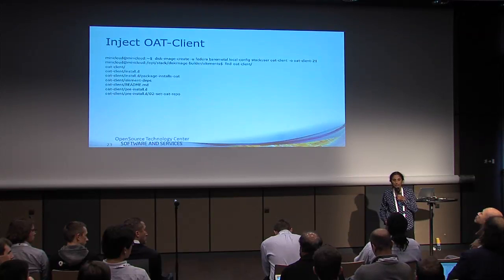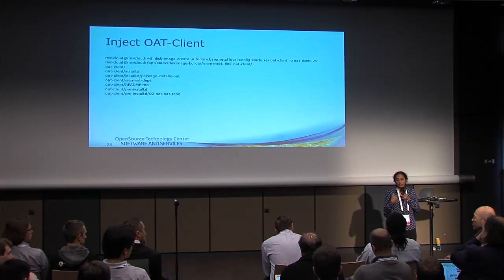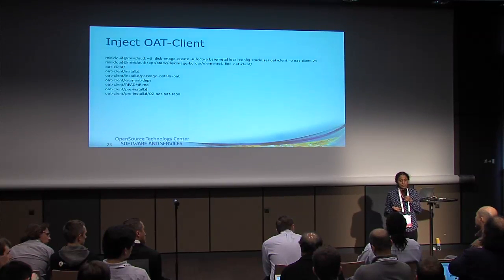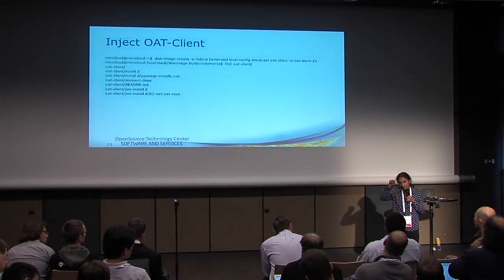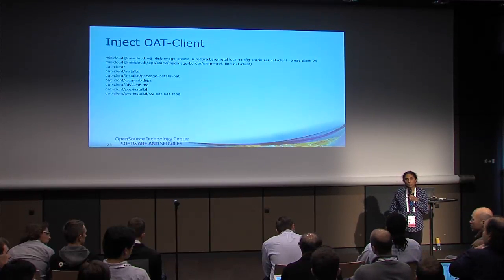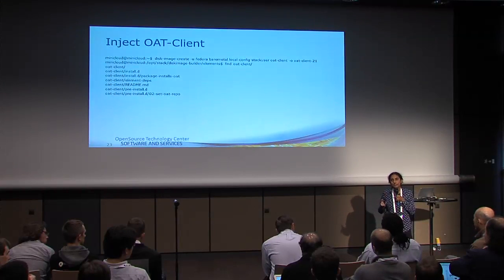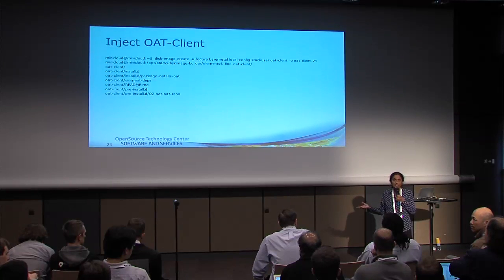Question. Is the random number generator exposed to the VMs? No. This one is mainly for your communication so that you don't have replay kinds of attacks. Like, I'll ask you, hey, give me your PCR values, and this is for generating a nonce. Or if you ask for some more public-private keys, then it'll bubble down into this and give you those keys. So it's not a high bandwidth random number? No. Yeah, the TPM stuff is all very low bandwidth, and it all comes over some serial line, so it was basically more secure, just to meet this need.